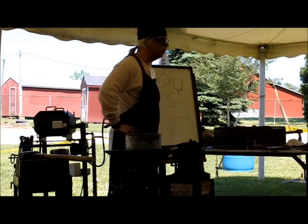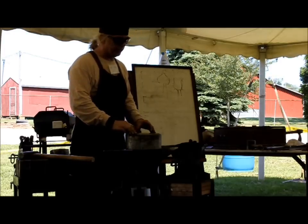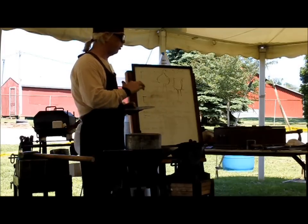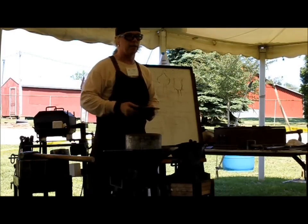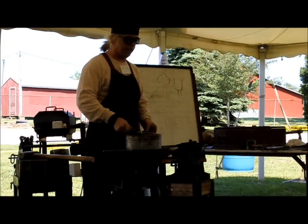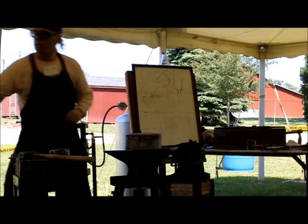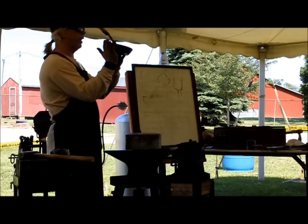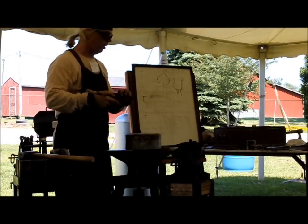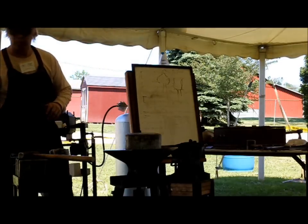The flat bottoms and the round bottoms all start out the same. I make a bowl. The difference is, on the flat bottoms, I don't fuss as much about making the bowl really smooth before I push it back and flatten. That's one of the big differences. And the other thing I've learned is it depends on how deep I make it as to how tall, how straight up and down the sides are, and I have to kind of anticipate and go a little bit deeper in that area. And again, I haven't figured out any kind of a formula for it.